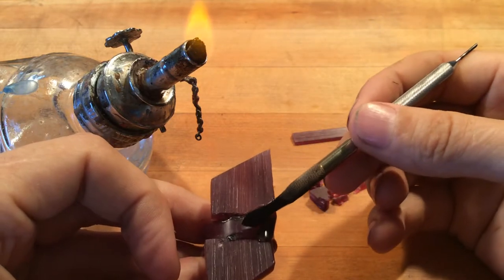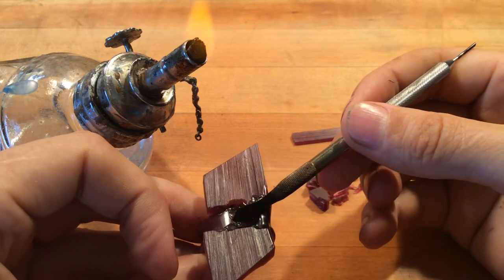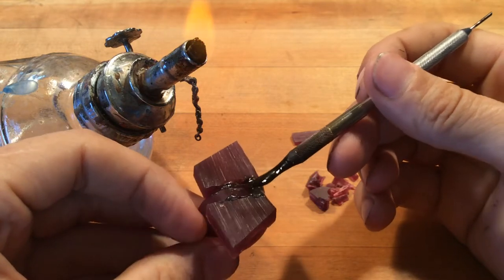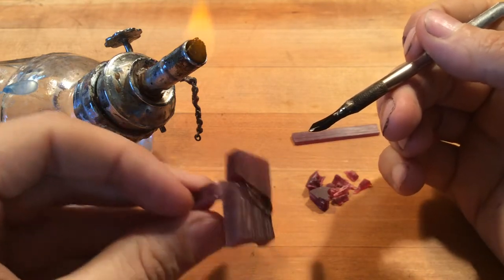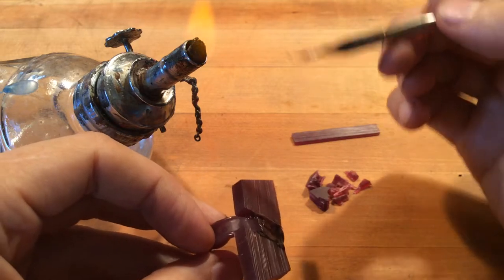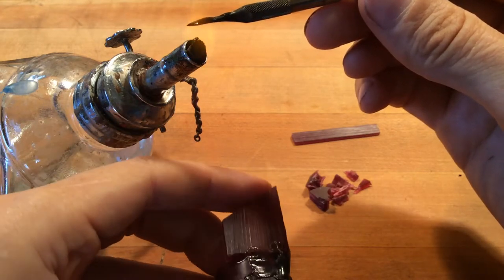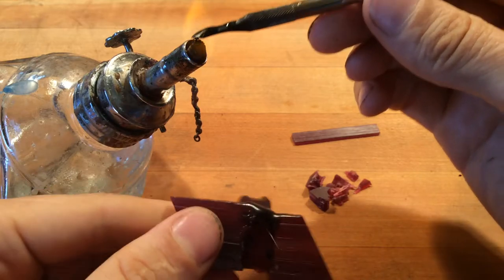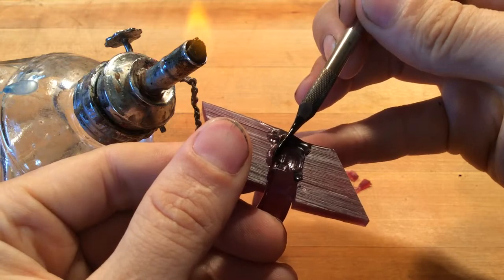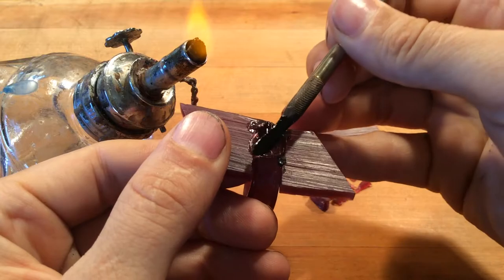So we're gonna patch the top. So I've got a hot chunk, and just remember the thermal mass held by your hot tool is what's putting enough energy to melt the bottom surface of your cold, like ring wax or part wax, to bring it up to temperature to fuse with that molten piece, okay? And so from there, you can come in and kind of redefine the areas you're trying to fuse. So I'm cutting, and then I'm switching to the backside and smoothing.